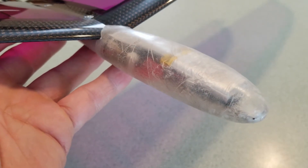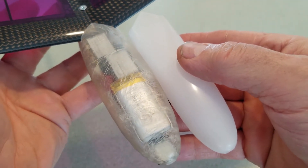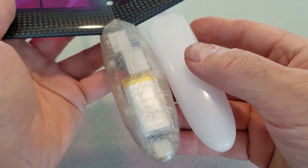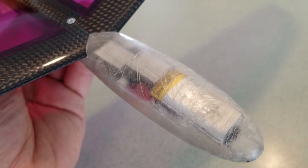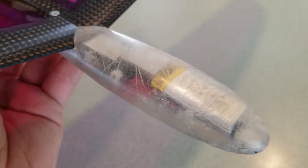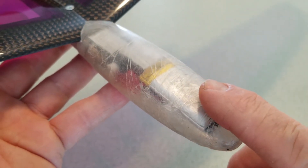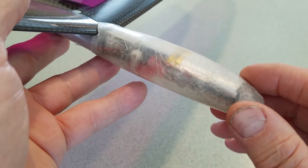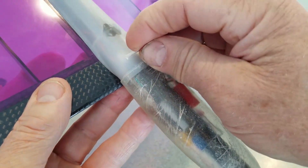This is not the stock nose cone for this model — this is a fiberglass nose cone I've made for it. Here's the original ABS plastic nose cone. I've laid up a fiberglass nose cone that swells out about an eighth inch on the sides and is about an eighth inch thicker. This nose cone is made from a single layer of two-ounce cloth using MAS epoxy resin. It only weighs one-tenth of an ounce heavier than the stock nose cone and has a slightly thicker cross section. For the advantages I gain, I'm not concerned with what I'm losing in aerodynamics.